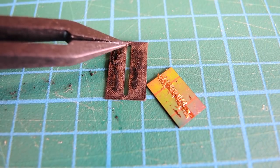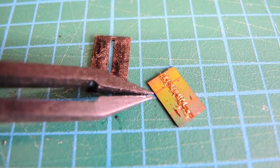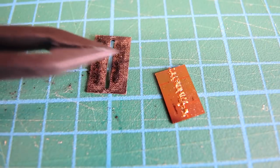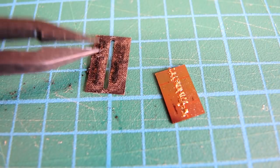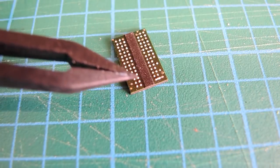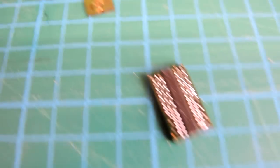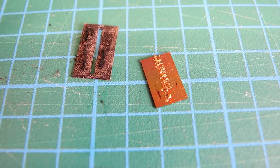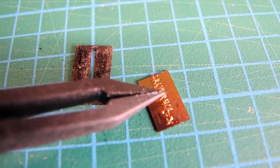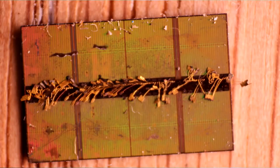You can see a slot has been cut into the substrate, because what happened is they took the silicon die and bond wires come up over and attach onto the substrate. Then there's a copper pattern on the substrate where they put a ball of solder. This is very unique — I don't think I've seen any other semiconductors other than DRAMs use this center bond arrangement. Here's macro photography of the silicon die showing the bond wires looping up beautifully and coming down onto a landing pad.